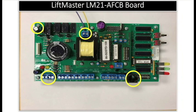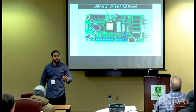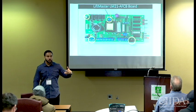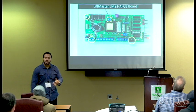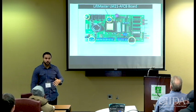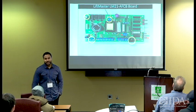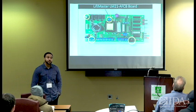You just have to take 13 to 15 wires and hardwire them back to all of these terminal strips. So wherever you have a safety, open, close, stop, you have all of that right here, because this system is actually going to take over the motor and turn it into a fully operational motor operator. And with the reverse limits on the operator, in the reversal of the operator, with that particular mod, now you have what we call a fire door operator, whether that be a GH or H operator, a gearhead operator, jack shaft operator. Now it is in compliance with fire regulation, if it's on a rated fire door.